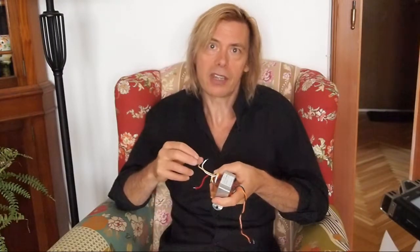The output transformer is like a fluid-coupled transmission because there's no direct electrical connection between primary and secondary — it's electromagnetically coupled. So really fast changes on one aren't seen by the other; that's the high-frequency response roll-off we talked about. Also, you can't put an infinite amount of power through an output transformer. The core gets saturated — it can no longer efficiently transfer power from primary to secondary. The excess power turns into heat, and if there's too much heat, the thing just burns up.